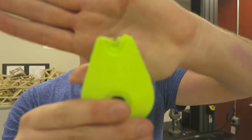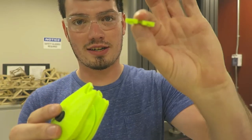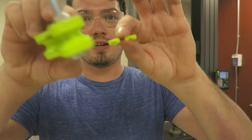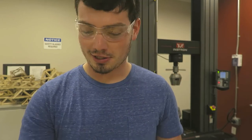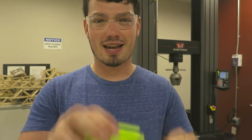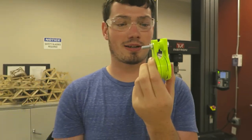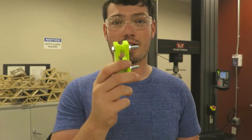So there are a lot of times I'm incorrect about statements I make. This one made 720 pounds, and you can see right here — it took the little ears off where it is. It's a little piece, not very thick at all. So the one I thought would do the best broke the earliest at 720 pounds, the one I thought might do pretty okay broke next at 838 pounds, and we're left with the one we haven't been able to break — the simplest one to print, uses the least material, doesn't look the nicest, but if this is the easiest to print and we still can't break it, that's got to tell you something.